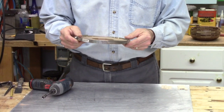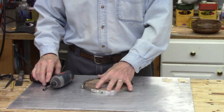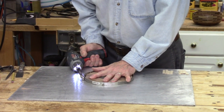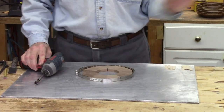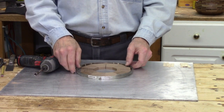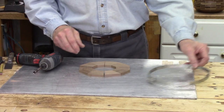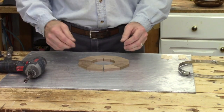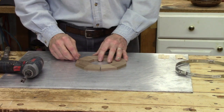I tested a bit before I came on the air, but I didn't have to go back and adjust any. I've got my saw set up, and nine times out of ten I don't have to make any adjustments — it's right spot on. When I do need to make an adjustment, I go to the sander and take a little off the long point or short point to get a perfect fit. Once I've got a good fit without the veneers, I know it's going to be a good fit once I add them.